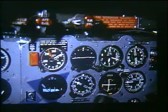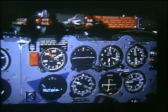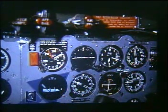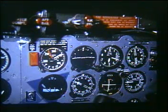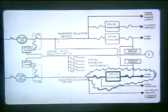The gyro horizon is 115 volt AC powered and does not require a step-down transformer. It is electrically protected by the same fuses that protect the 26 volt AC step-down transformer for the turn and bank indicator. The first officer's single 26 volt AC step-down transformer is located adjacent to the two step-down transformers for the captain's flight instruments on the right side panel inside the main junction box.